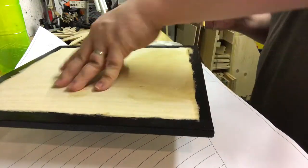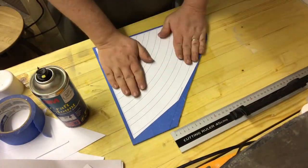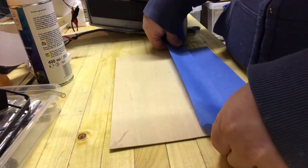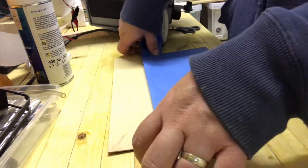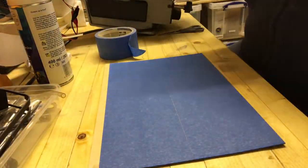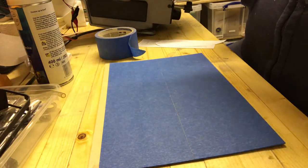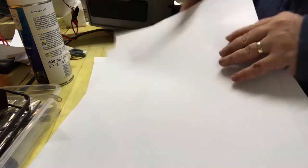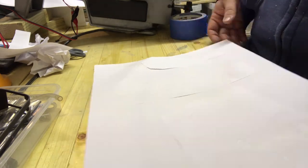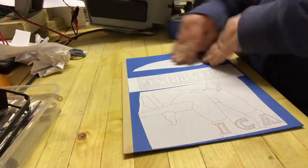I picked out some 3mm plywood for the background pieces and some 1.5mm plywood for most of the build. Now if I had the time and money I'd have got some nice veneers and maybe cut down some quality wood, but for now this project is going to be 100% plywood. I then proceeded to carefully cut out the elements — as these needed to fit back together I took great care and used a thin blade, specifically a number 3 Flying Dutchman.